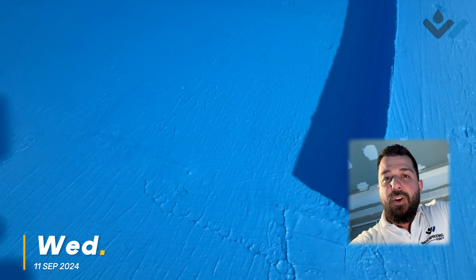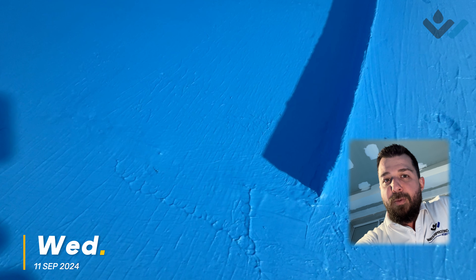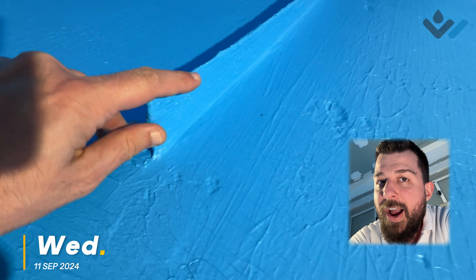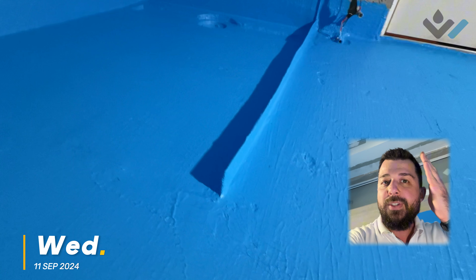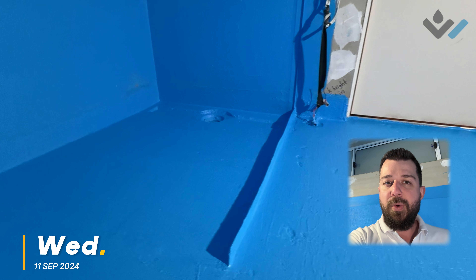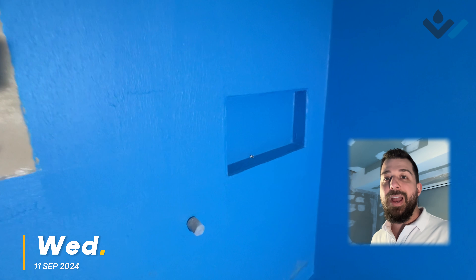That's just how this design is going to go because we really want our underfloor heating running into the shower - we want the benefit of that underfloor heating drying out our bathroom and shower area every time it gets used. Yes, it's a compromise, and out of the box it probably doesn't necessarily comply with the standards, but we've evaluated the performance and discussed that before. We are keeping this part in - it's a little bit high at the moment and will be cut down to match the finished floor level because our glass panel is going to be sitting directly over the top here, so we won't have any water trying to run out underneath that glass panel.